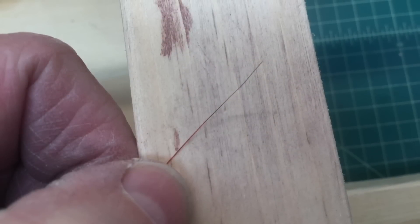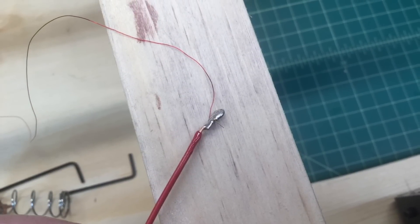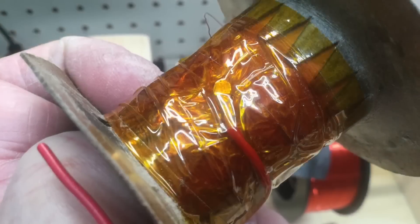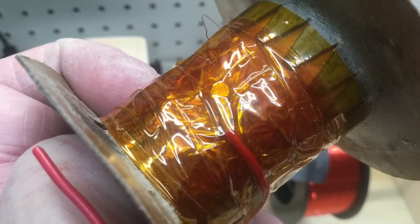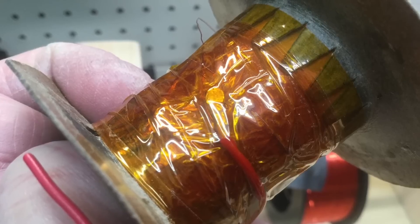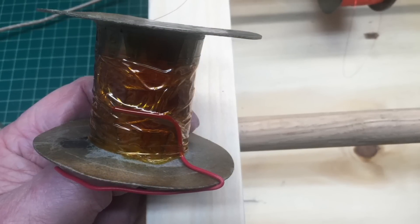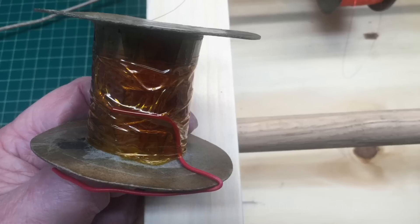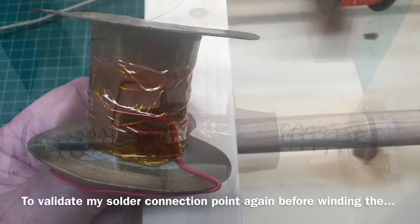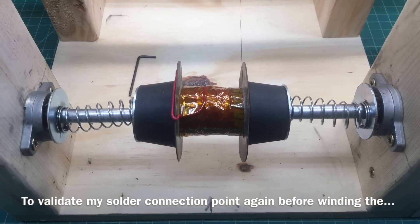Here I'm cleaning the magnet wire on one end and soldering a lead to it — I think that's 22 gauge. I'll place that between a couple layers of Kapton film tape and run it back to the sides, so that will be just one of the leads. I then took a DC resistance measurement all the way through the bundle of wire I just purchased to make sure it was good, and it matches what it should be for that length of wire.